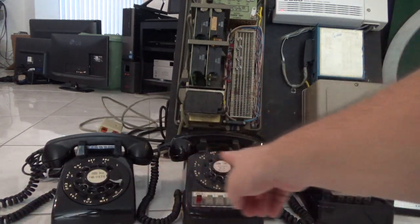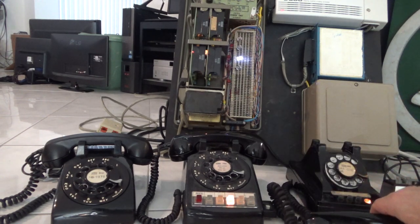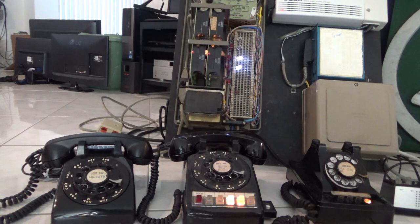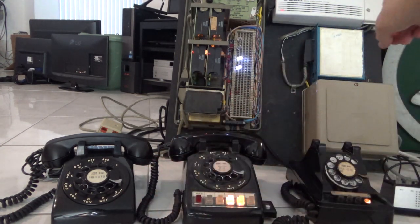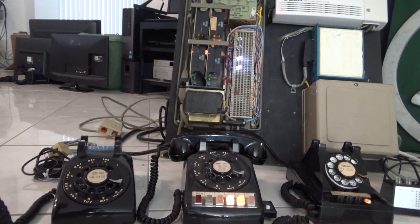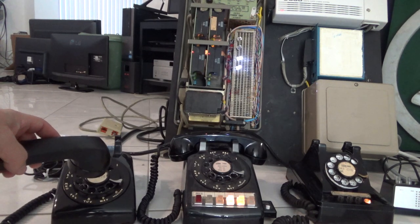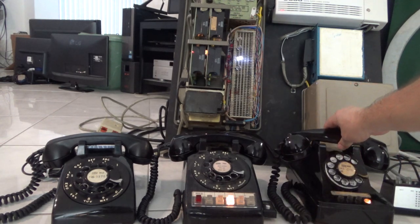I'm going to call the 502 from the 444. Since it's a three-line phone, I'll go on line three, extension 23, go off hook — you can see the lines light up. I dial 24 and they all ring, including the single line on the left. Line four is flashing — that's ringing directly from the Panasonic, not from the key system. I answer it, it stops ringing, the line is seized, and I'm off hook. Line four is also lit on the six-button set. I hang up and the line goes out.